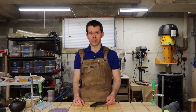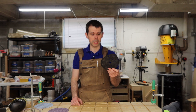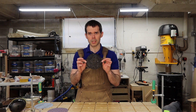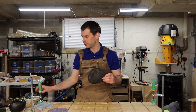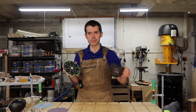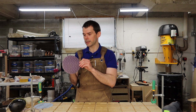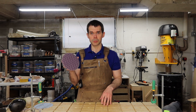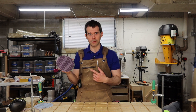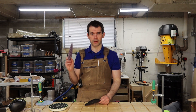A couple of things to note, particularly specific to Festool users — though there may be analogs with other sanders. You do need to use intermediate pads on Festool sanders, or you really should, because the discs themselves heat up a bit and will tend to cause some damage to the hook-and-loop design of the pads. So where you normally have the pad that goes on the bottom of the sander, you want this intermediate pad in between that the sanding net then attaches to. This is how you should use it on a Festool sander.